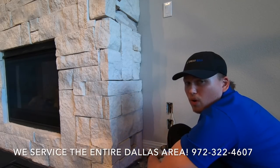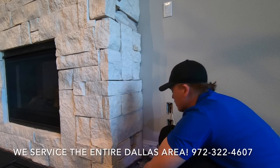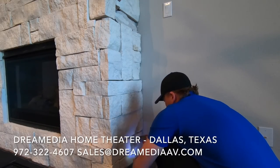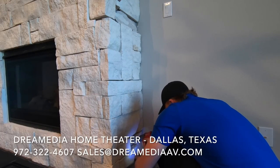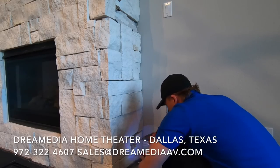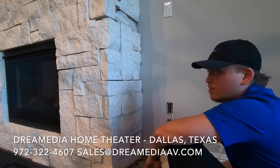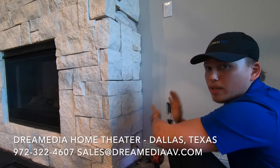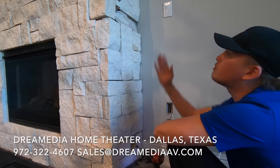This is all just drywall and mortar, so it's really easy to get through. This home was probably built this year or last year, so it's all dead space behind the fireplace. So it's really easy to shoot a fish rod up there.